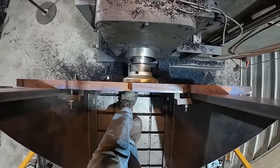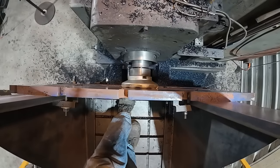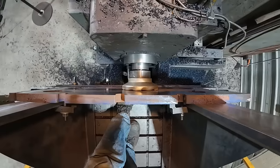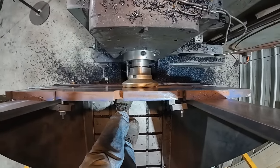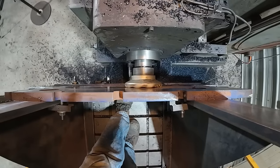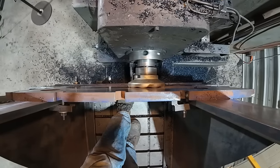I've got my foot up against it right now, trying to calm that vibration, and it's not helping. So, like I said, I think a slower spindle speed, and yeah, we'll take care of it. Light cut, light depth of cut, and a slower spindle speed.